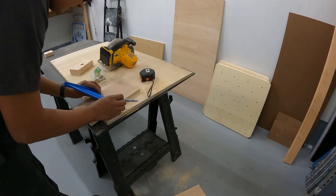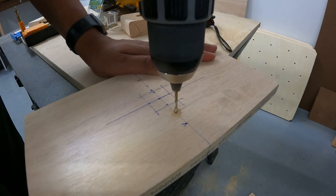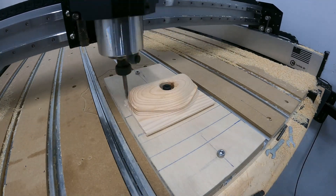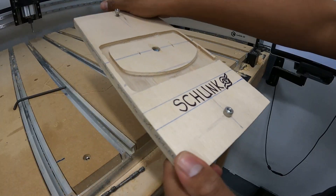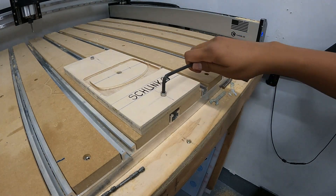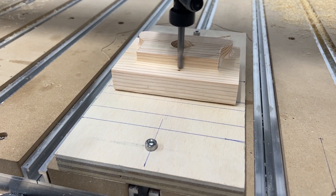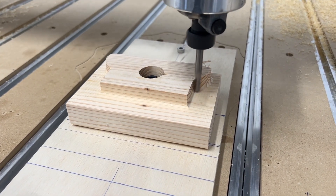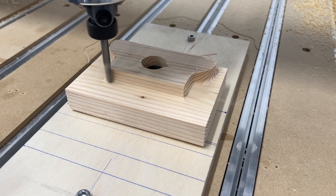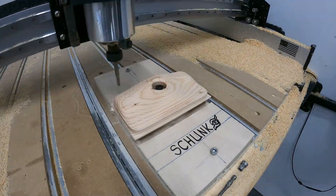After the holds were cut with counterbores and holes machined in, it was time to make a fixture to hold them. I took a piece of 3/4 inch plywood, counterbored the back, and put a t-nut in it so a normal anchor bolt goes through the hold blank and holds it to the fixture plate. I tightened everything to spec with a torque wrench. I think I left some performance on the table, but with only one end mill and not running production, I didn't push it — though I could probably bump the material removal rate up by 25 to 50 percent. The 3D surfacing had a 25 thou step-over.